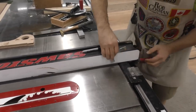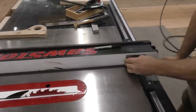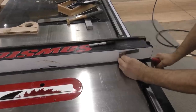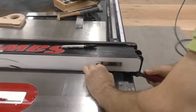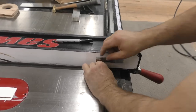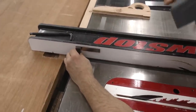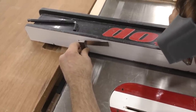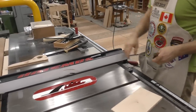I'm using a square as something I can drop down. I want to get this — this is where those Jetlock things are so nice. You can see I'm still hitting the metal, so I'm locking it in place. I would say that is perfectly parallel at this end. Now I'm going to go down to this other end — hear that? If I put that down and try to tell you how much gap we have, if I could fit a shim in there it wouldn't be much more than a couple thou.